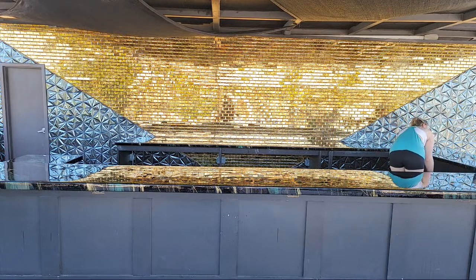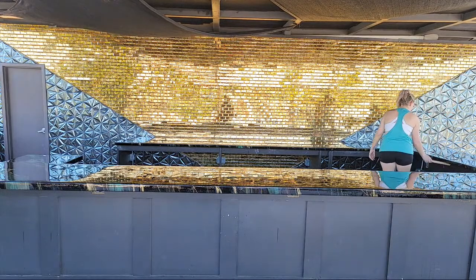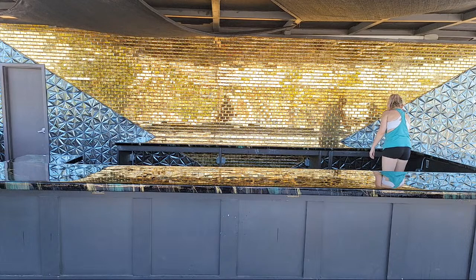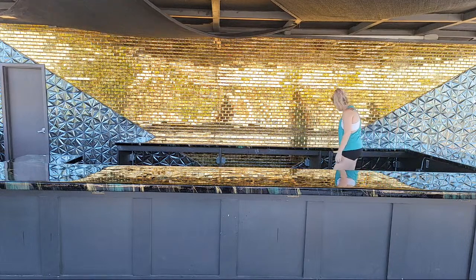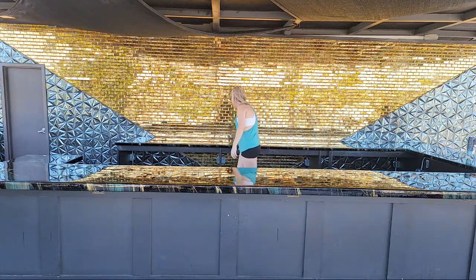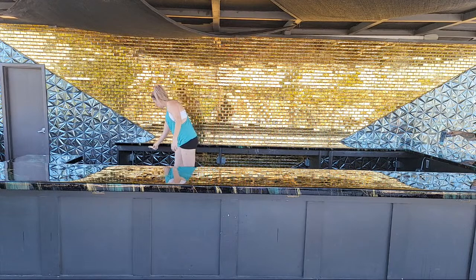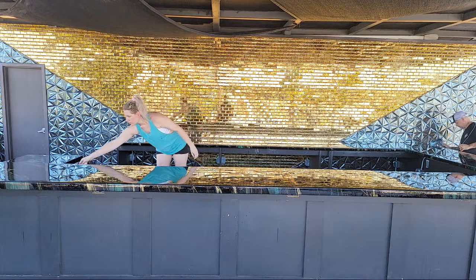But you're not getting as many bubble pop-ups as you did yesterday. There aren't as many bubbles as yesterday because we didn't mix it as hard, or maybe the resin wasn't as cold. We had the resin inside to keep it cooler, and that gives us more working time. It's another cheat.